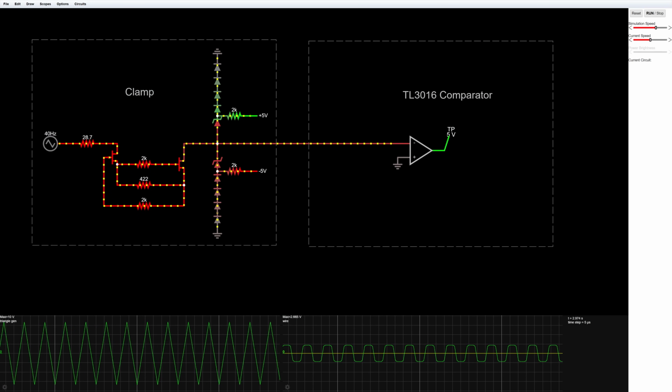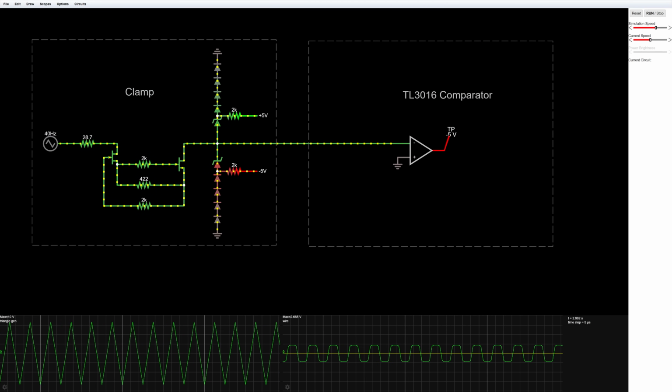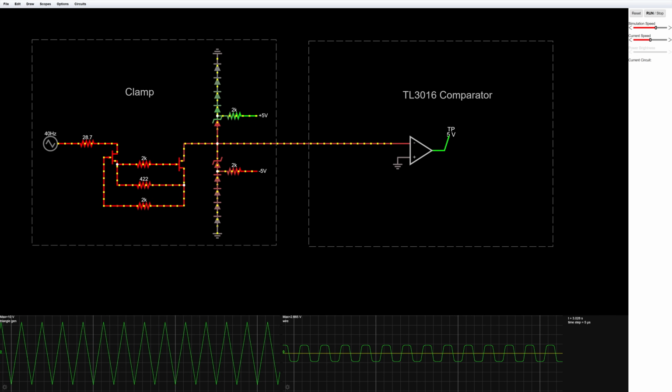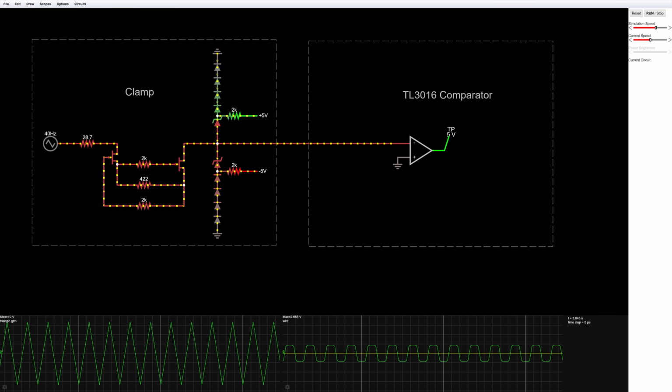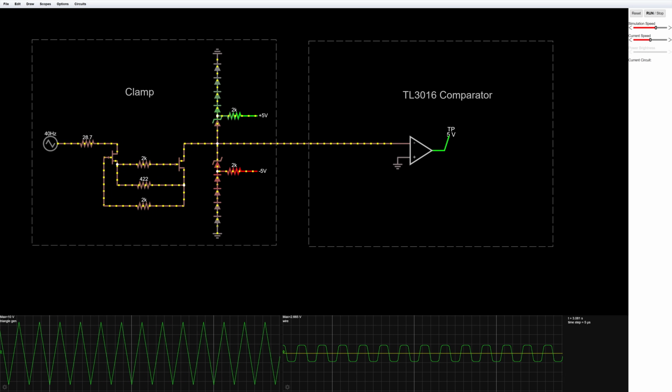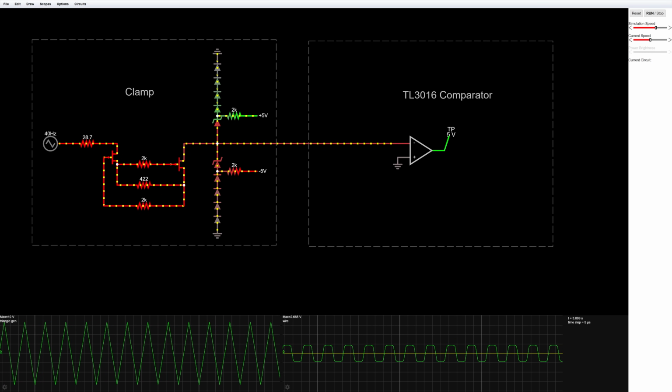They came up with a pretty complicated constant current clamping circuit that limits the slope voltage without overloading or causing instabilities for the slope amplifier, all the while having minimal influence on the zero crossings. That seems to satisfy the Precision Texas Instruments comparator that they are using.